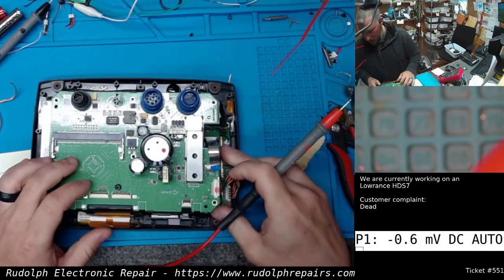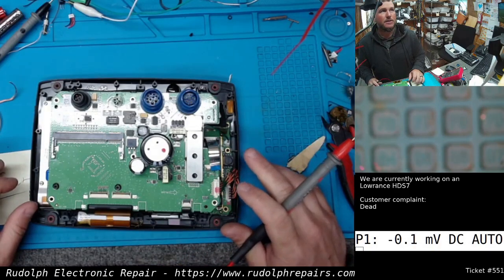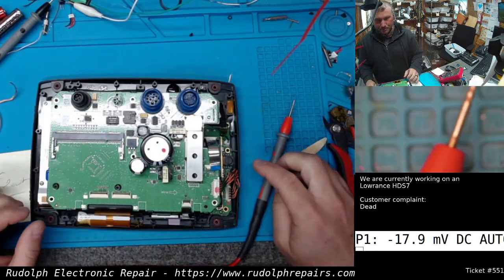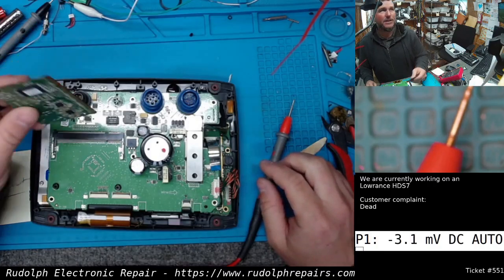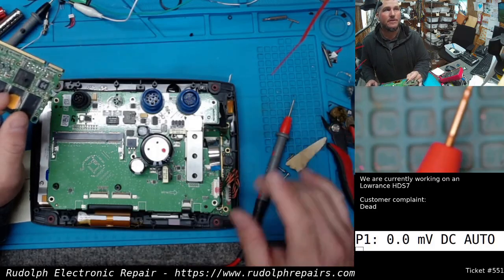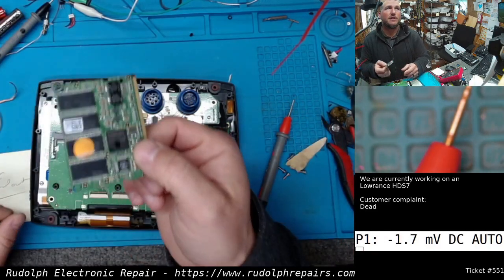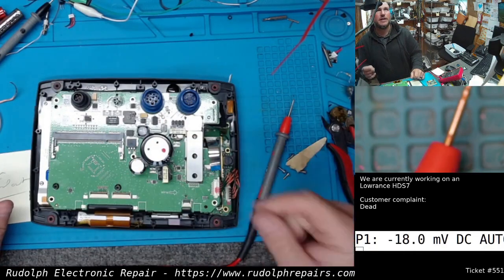All the voltages seem to be okay, but let me back up. We're getting about 38 to 40 milliamps on the power supply when we press the power button, and we get that whether the CPU card is in the motherboard or not. So that tells me right there — simple test. Check the current. Is it around 40 milliamps? Take the CPU card out, try to power it on. Still 40 milliamps? The CPU card is not booting, not starting. The CPU is not telling the other power supplies on the board to kick on.